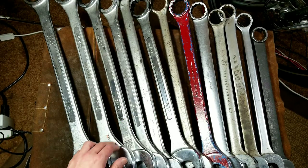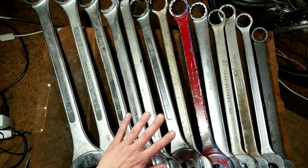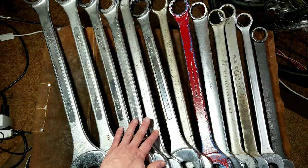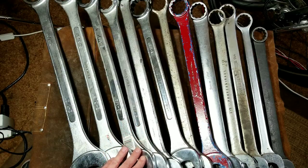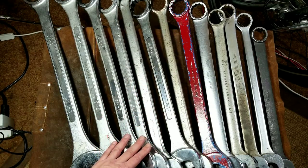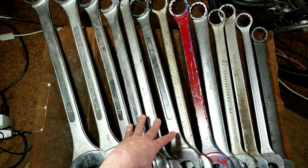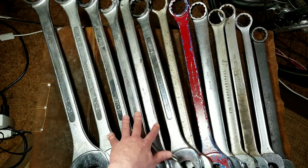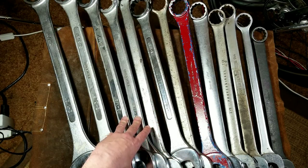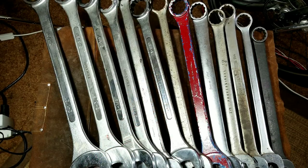This also provides a closer look at the quality of the wrenches and how some stack up at the larger sizes. A lot of times when you get to larger tools, regardless of manufacturer, the fit and finish isn't quite as nice — they're more difficult to deal with and the expenses are much higher. Everything from the tooling — the forges that forge the big wrenches obviously have to be a lot larger. They reach a point around the three to three-and-a-half inch range where they don't even forge tools anymore, and with sockets it's about the six-inch range. The forging presses are too big, the dies too expensive to justify making just a few wrenches. Most of those giant tools that exist are custom machined from billet steel.